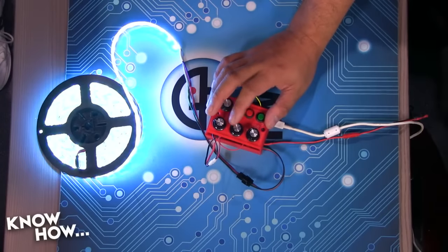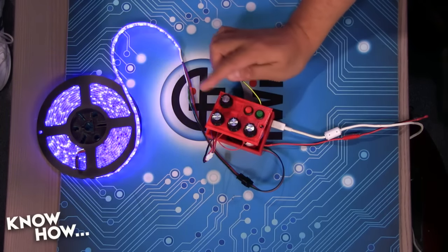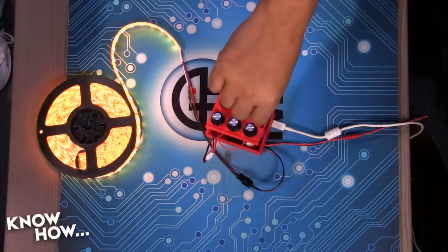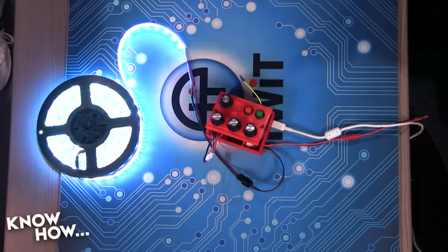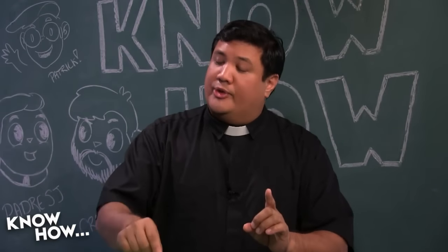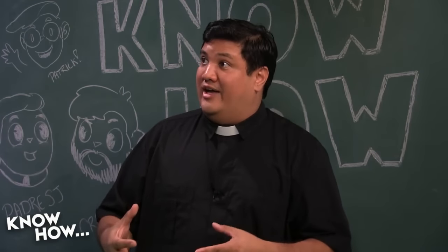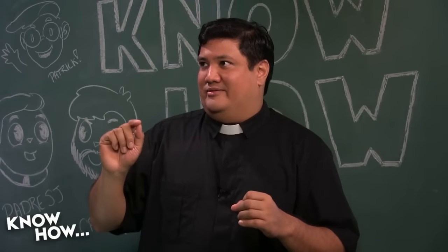All right. We're going to take the calibration data and show you the code that you need to be able to enable your potentiometers. So now we know how we're going to get our input in from the potentiometers. That wiper is sending a particular voltage between 0 and 5 volts. The Arduino is turning that into a digital value. We did notice that value was fluctuating just a tiny bit, right?